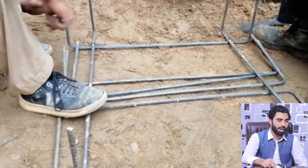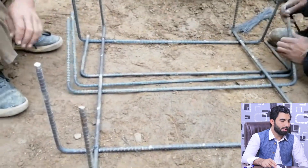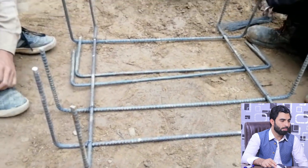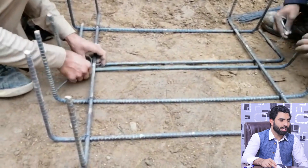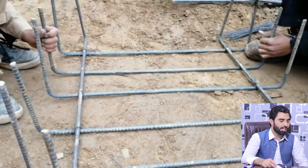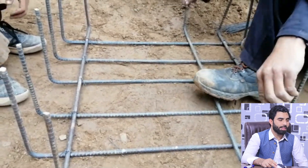The footing size is four by four feet, which is for individual footing. The other column footing size and column size are all the same, and they use doubly mesh at the bottom. You can see how to prepare a singly mesh steel reinforcement for the footing — they use 12 millimeter diameter steel rods with hooks. The hook length is about nine inches and the spacing is six by six inches, or 150 by 150 millimeters. Steel fixers are working on this mesh.